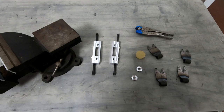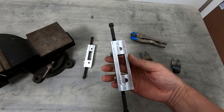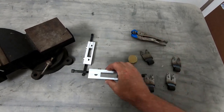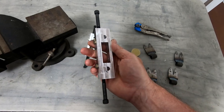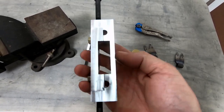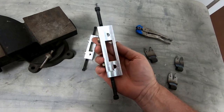All right, I've got a few things to talk about here. So before I left yesterday, I was able to remake these clamps for the landing gear. These turned out perfect. I mean, I really am very happy with these. These are interchangeable this way and interchangeable with each other. So I was able to make these very accurately the second time. And you can see I've got my gap that's supposed to be there, 0.3 millimeters, to allow a little bit of clamping pressure when you tighten these bolts. But everything with these turned out great the second time.